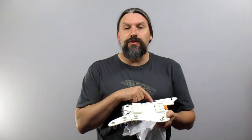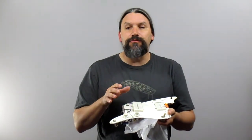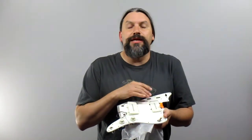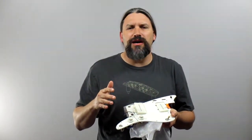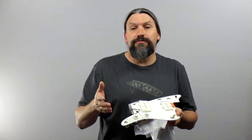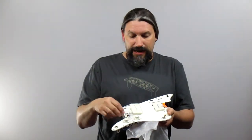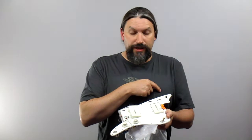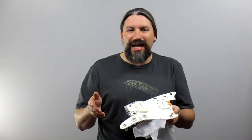If you're familiar at all with the original layout of this electronic scheme — the original one had a rhythm circuit. What it did was you'd turn it on and eliminate the bridge pickup, leaving only the neck pickup with an independent volume and tone. It's a little darker too, with different value potentiometers on these little rocker switches. My friend Brett Hagan would call it the 'big titty woman tone' — you'd have independent volume control so you could have your master volume and master tone set, then switch to the rhythm circuit, go quieter with just the neck pickup. But guitar players were like, why would I want to be quieter? I want that for my drummer, not for me.